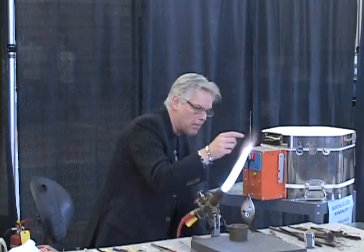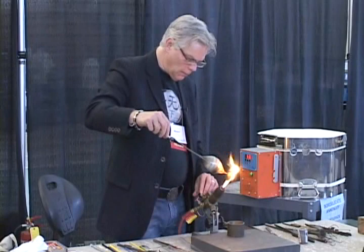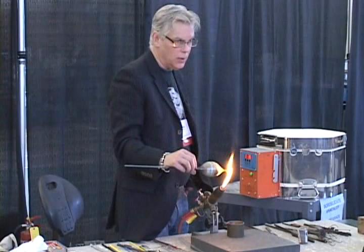Now, one of the crucial things about this soft glass: if you put the foot down on a cold surface like graphite with borosilicate, probably nothing would happen. But if there's even one grain of powder on that, and I put that foot down on it, it would crack it. You gotta make sure that surface is clean.